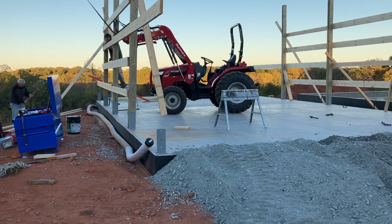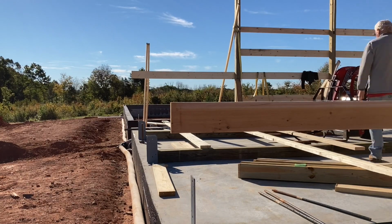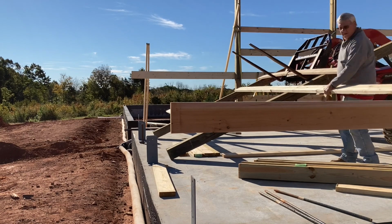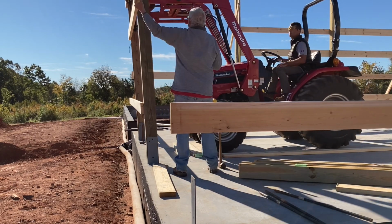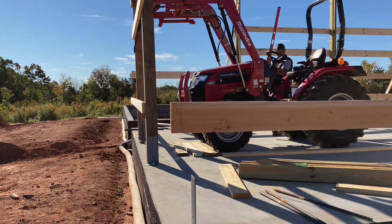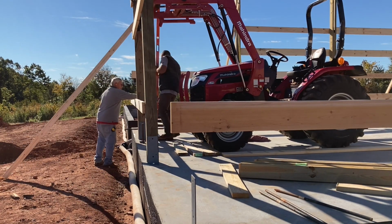And here you're going to see me lose my camera again, the wind. And this is the end wall. This is our last wall that we set for the day, the end wall. We pushed up with 2 posts. It was pretty easy, and we offset the girts so we didn't run into issues hitting the end wall girt boards that were sticking out for the corners.